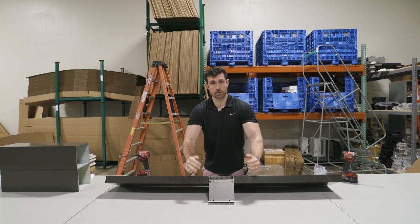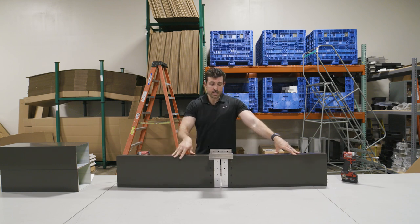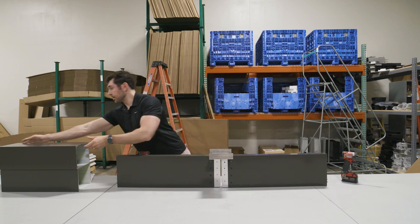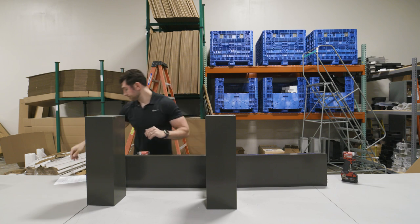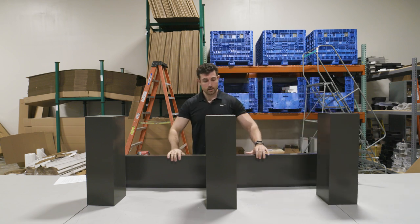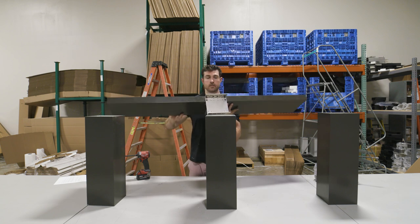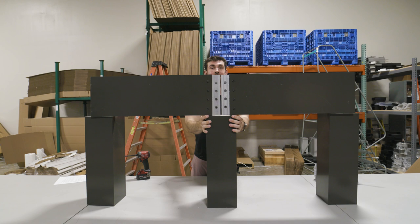As you can see, I added two more screws to the outside — again, this will give you some extra strength when you place this on your pergola unit. So now we have what would be a 24-foot length of beam plus the post connector. What you're going to do next is lift this whole assembly onto your posts. You and probably two friends are each going to go up holding a piece of this beam and place the entire assembly into your post. Now you have two units coming together with a single post in the middle. Then you'll go through and attach your screws all along the inside of the post into this post connector.